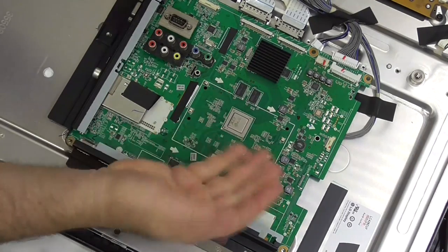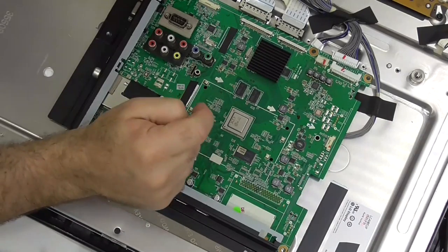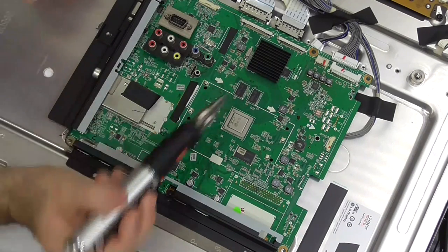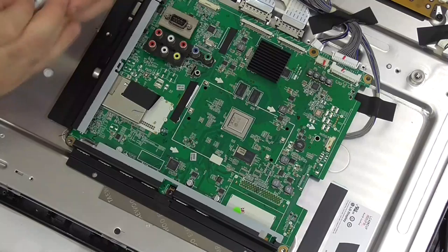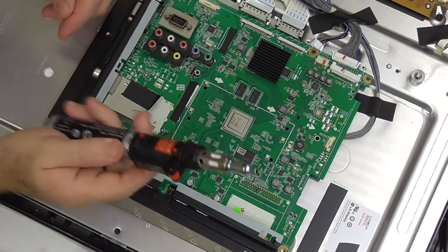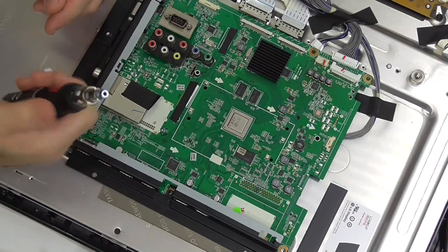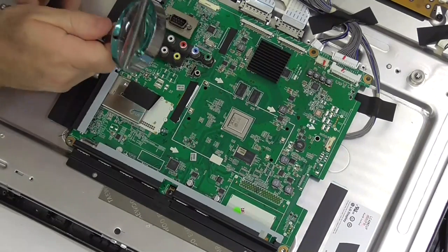What I've done is used gravity - pressed the pen which releases the flux and let that dribble down. In theory it should flow in. I'm not sure how many rows of balls this thing has got. This is my hot air tool - well, a butane torch with a hot air attachment. I've got it on its lowest setting and it has an igniter.